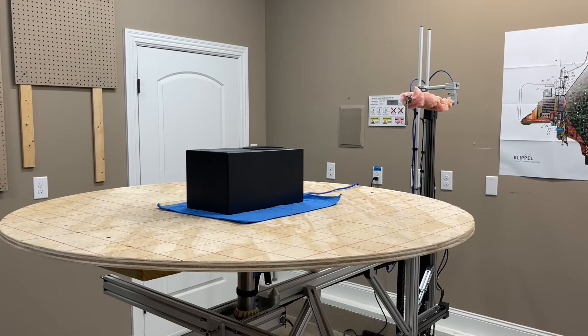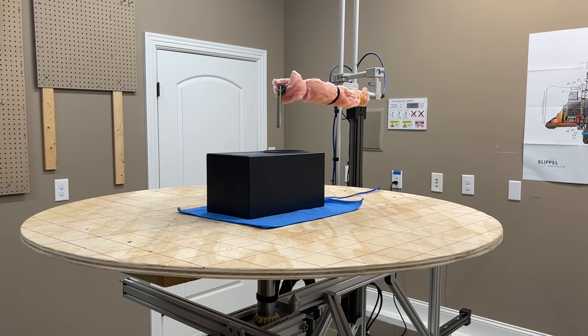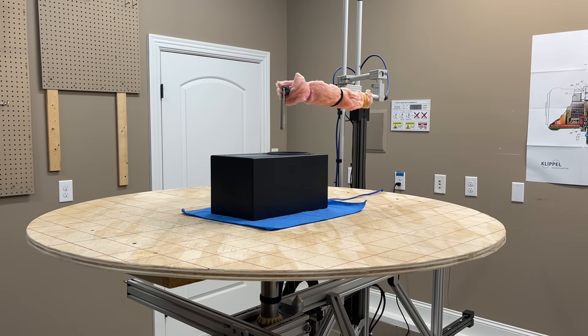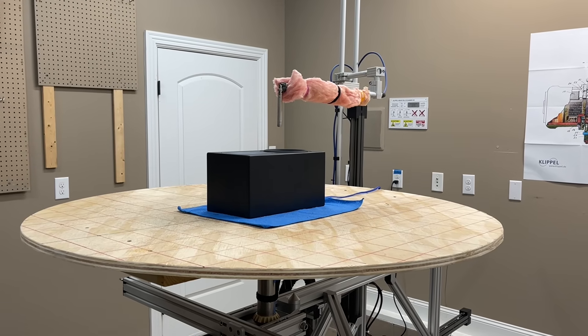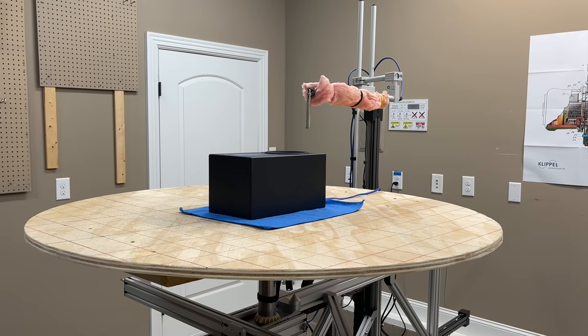Here come the on-wall measurements. I wanted to give you an idea of the performance of this speaker when put on a wall. Keep in mind that pretty much every speaker, once you put it on a wall, is going to suffer the same effects you're about to see. I'll cover this more in depth in a later video. This is the positioning of the speaker on my Klippel machine — I'll show you a short video here. The Klippel software is able to basically emulate a full infinite baffle wall for the speaker. Even though my baffle is not infinite, the software detects the edges and mitigates the baffle loss effects, essentially emulating a full baffle.